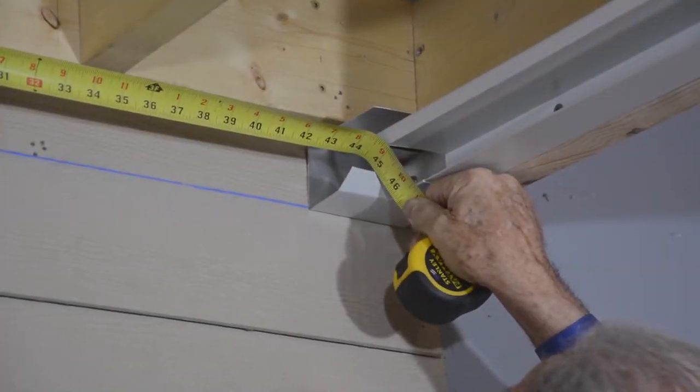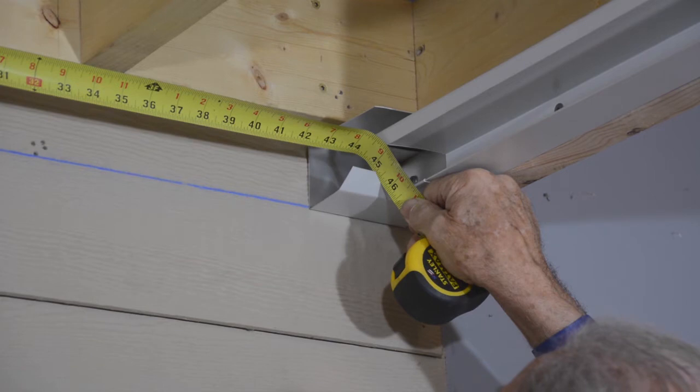It is important that wall channels meeting in corner boxes not overlap. Measure the length of the back wall channel with this in mind. A wall channel does not need to be inserted more than an inch or so into any corner box for adequate support. The procedure for trimming and installing the back wall channel is the same as previously shown.